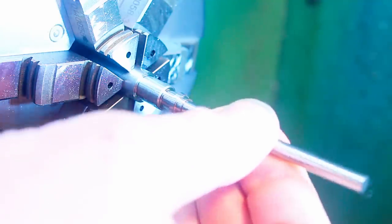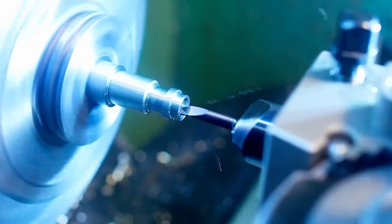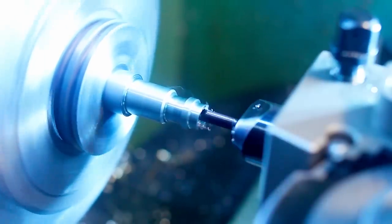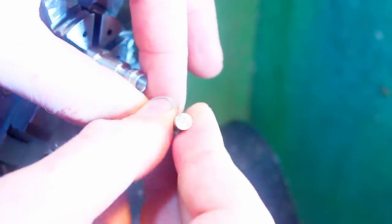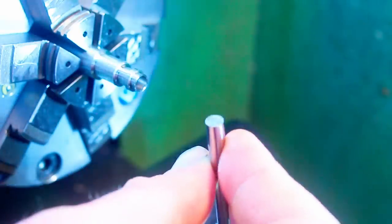Okay, this is the nominal size pin. Okay, it wants, but it doesn't. Okay, I took another 10 micron pass, and this is the nominal size pin, 5.65, and this is a close fit. Let's get a 5.66 pin and check again, and the 5.66, that's 10 micron over nominal, doesn't fit. So hit the dimension pretty good.